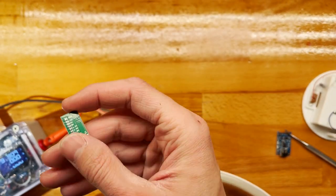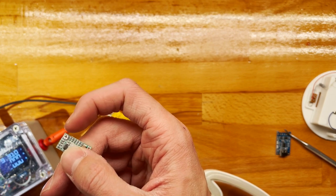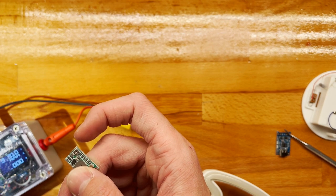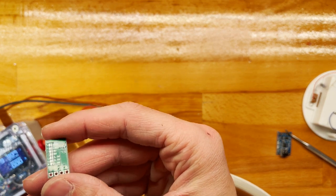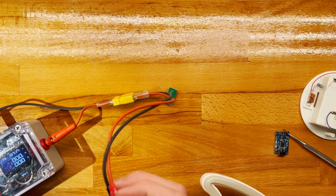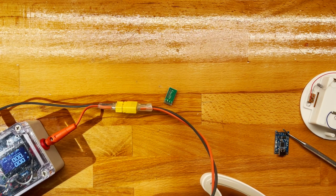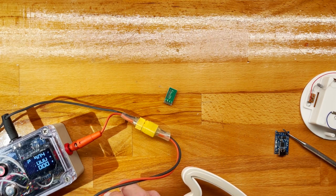it's a bit much. So what else do we have? The reason why I would prefer to use the set resistors on the side instead of the rotary variable resistor is that these do get moist over time, and they do degrade, and they do have imperfect contact. So they're quite unreliable in my experience. So we still have 2.5. Let's try 2.5. I mean, you don't have to read from this. So, no, really? Not at all. Okay.